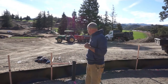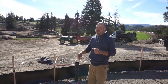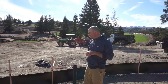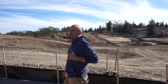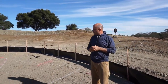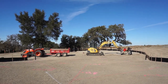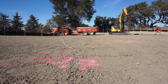That's what we're looking at here — this barrier, mainly for water intrusion. We want to make sure that the 12 inches of sand is protected and we don't have any outside water entering our putting green profile. Now let's talk a little about drainage and how it works. When we build a USGA putting green, it's comprised of four inches of gravel and 12 inches of sand.